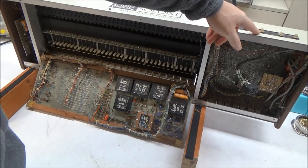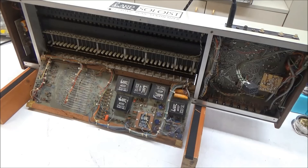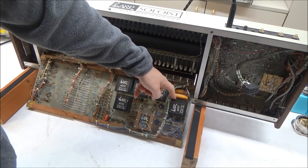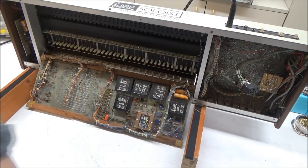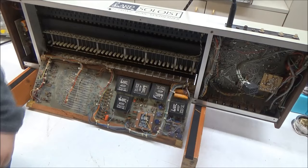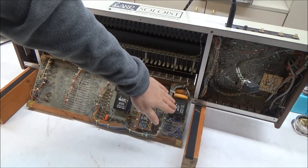Earlier I said I'd explain why there's a fine tune knob on the back of a Soloist and not the Pro Soloist. With the circuit board tray lowered, we can see the reason: the Soloist uses a 4027 sub-module — the oscillator sub-module found in the ARP 2600, the ARP Explorer, the ARP Little Brother — a very standard ARP module. It's a traditional volts-per-octave VCO, so you can detune it and feed it control voltages. That's a major difference between the Soloist and the Pro Soloist, which has a very funky oscillator design.